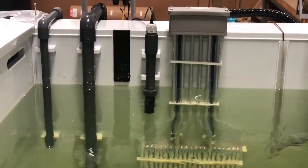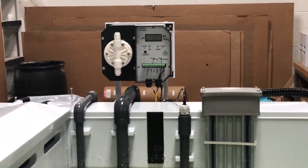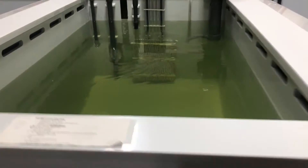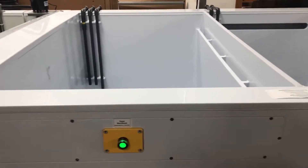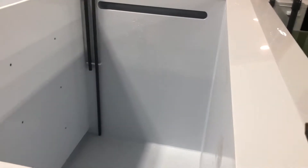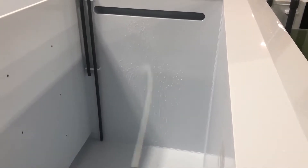We're also able to monitor pH in the system and dose in chemical as needed based on pH. After passivation, we have a double cascade rinse which has flow controls on each tank to allow for the flow of water to be recycled through a DI bed.